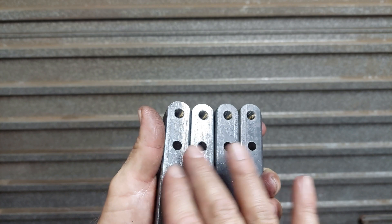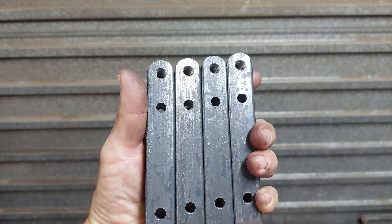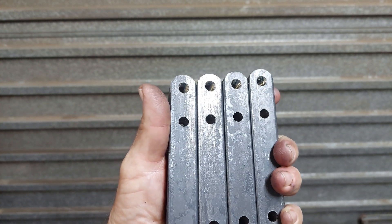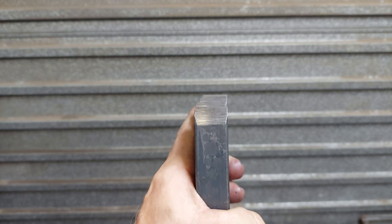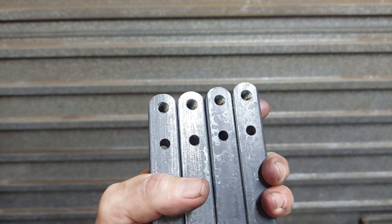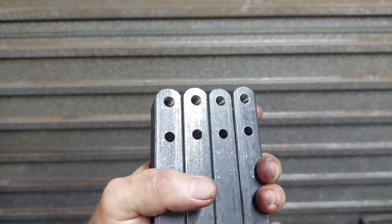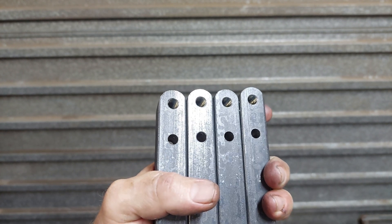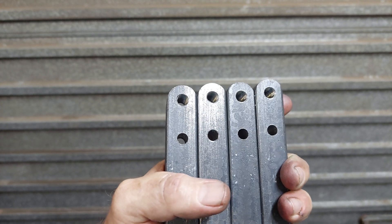There's no messing around with tap followers, hand tapping, or turning yourself through the face to get a hole like this tapped — and it's a 20mm deep hole. I've saved myself a lot of effort using the combination drill and tap combo. I know you can't do blind holes with them, but in this case it's a through hole, so I just went for it. It worked out nicely.